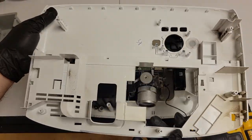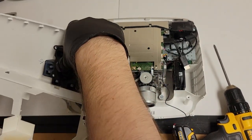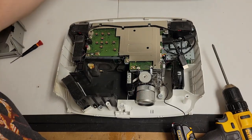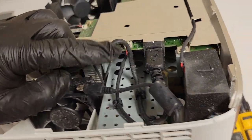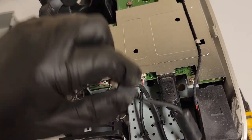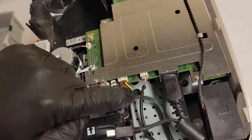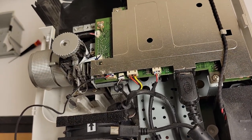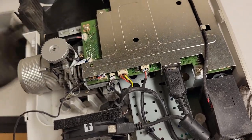That's really cool. I've actually never seen that hooked up. I've seen the provision for it in the 2050 and the 2150, but never in person. Now you guys can see it. They give you a tiny HDMI wire that plugs in right here, and then we have a mini USB plugged in here, and that's literally just power. You can see there's just two wires instead of four. So there's no data. It's just positive and negative.